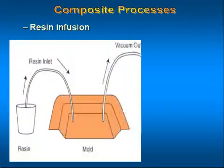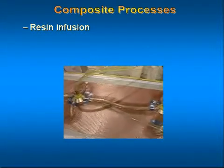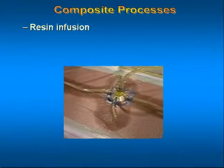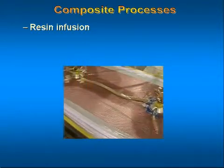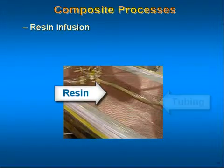The vacuum infusion process, sometimes referred to as VIP, is a technique that uses vacuum pressure to drive resin into a laminate. Materials are laid dry into the mold and the vacuum is applied before resin is introduced. Once a complete vacuum is achieved, resin is literally sucked into the laminate via carefully placed tubing. This process is aided by an assortment of supplies and materials.